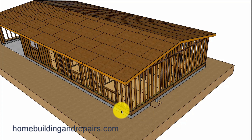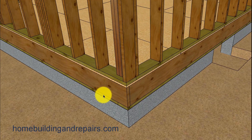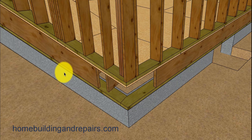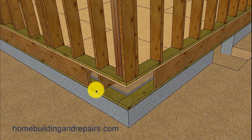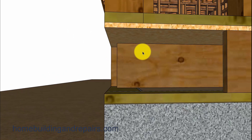In this video I'm going to try and provide you with a few ideas how you can replace the rim joist that will be connecting to the other joist perpendicular to it, or will be end nailing into the joist. Before we get started, let me provide you with a better idea of how these walls are supported by the joist and the rim joist. Here we can see where part of the joist itself is going to be underneath the wall framing, and on a 2x4 the rim joist is usually going to be an inch and a half thick, which would leave us two inches of framing structural support underneath the wall — which in most cases is going to be enough to support the wall and keep it from going anywhere.